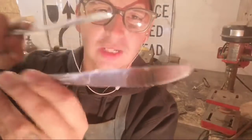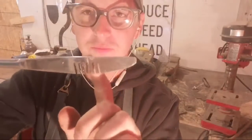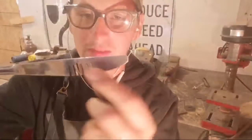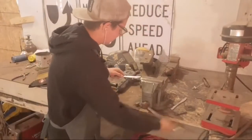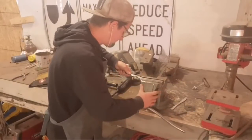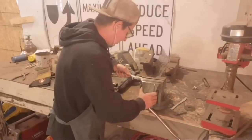These little notches that I have in there are going to allow me to bend it. And then to get rid of those notches, I'm going to be doing some tack welding, which is going to give it a scaly type effect, and then I'll clean it up with the wire brush. So, the first time I did this, I wasn't counting on it adding to the texture, I just needed the shape to be there, but it's a happy coincidence.